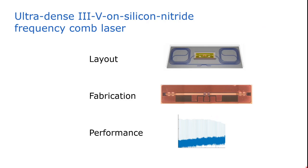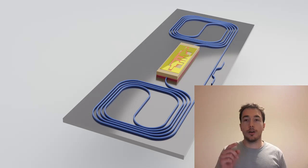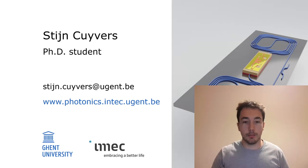So I've discussed the layout of our device and how we combine silicon nitride with the III-V. I've discussed the microtransfer printing process to fabricate the device and to heterogeneously integrate the III-V device. And I've discussed the performance, outlining the excellent noise characteristics and comb density. Not only do we have excellent noise performance and a very dense comb, our device also offers turnkey operation and is a single device — a single fully functional optical frequency comb source that can directly be used for spectroscopy, datacom, microwave photonics, or other applications. If you are interested in my work or have questions, please reach out — I will be happy to discuss my research results with you.